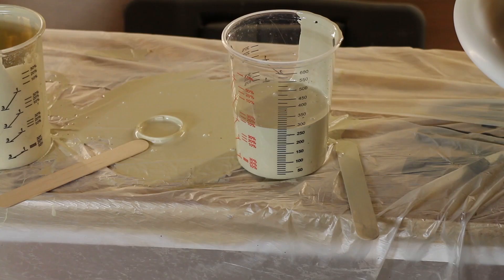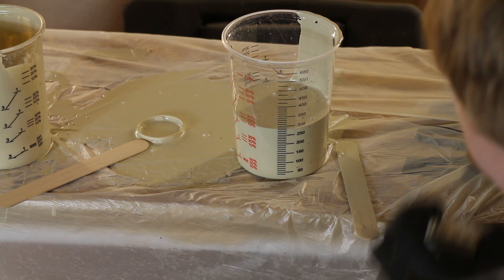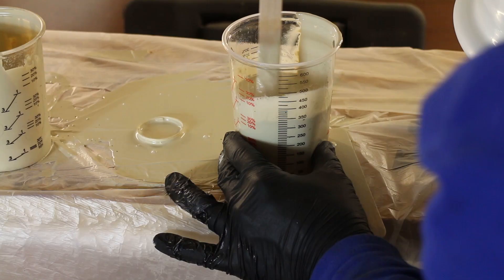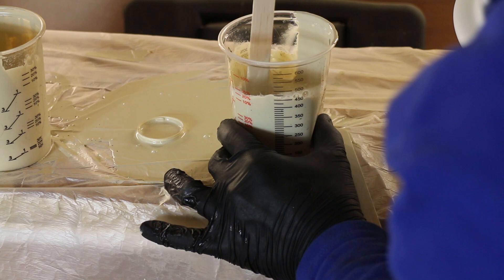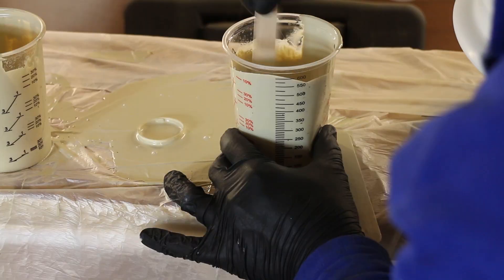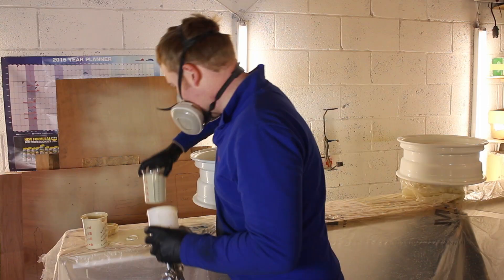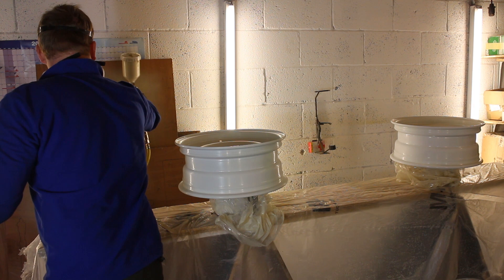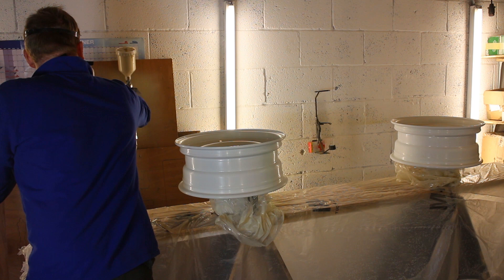As this is a single-pack product we can use a carbon filter air mask and gloves. I'm using proper mixing beakers because they make mixing and measuring paint so much easier. We recommend about 10–15% thinners for this paint, but because it's so cold I've had to add more to suit — using xylene thinners and mixing with proper paint sticks, also known as tongue depressors, found cheaply on eBay. Don't get air in your paint; mix thoroughly but don't froth it up. Decant it into your HVLP gun — though you can also roll or brush this paint. I had to add more thinners because it's cold even though I've heated the workshop with a space heater. Keep the air line out of the wet paint on the wheel.